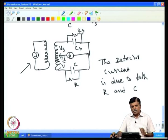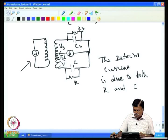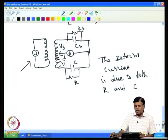So, one can balance RS and R separately. In this case, we assume that RS, the leakage or saturation resistance, and R are very high. If it is very small, then we will have another set of problems, and we have to modify this. There are ratio transformer bridges called double ratio transformer bridge and so on, but we will not get into this. Here we assume RS and R are very large, but still it is a considerable amount when capacitors are very small. So, under this assumption, let us see how the Lock-in amplifier can be utilized here to balance the bridge, that is, to separate out in phase and out of phase components.